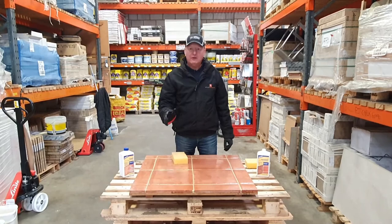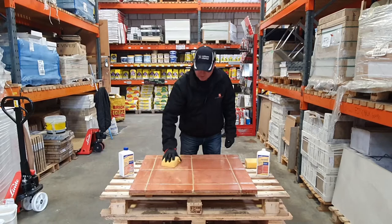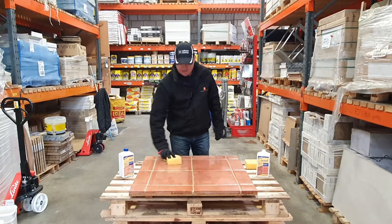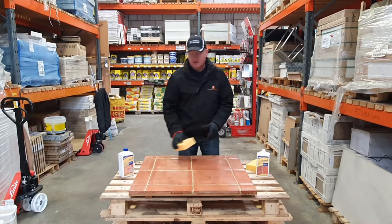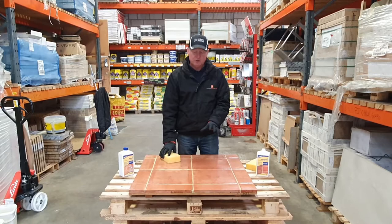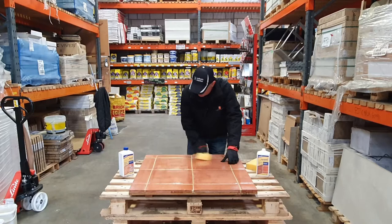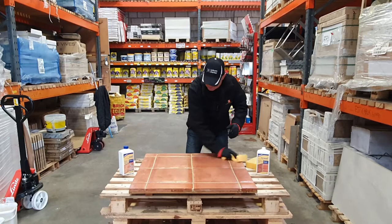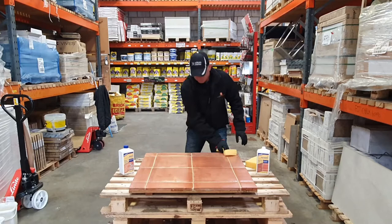Welcome back — we've had five minutes for the impregnator to soak in. We kept it damp by wringing out the sponge so that some of the impregnator continued to come out onto the tile. As you can see it's come up really nice. What we're going to do now is take off the excess, because if you don't take off the excess it will soak in unevenly and could spoil the effect of the tile.